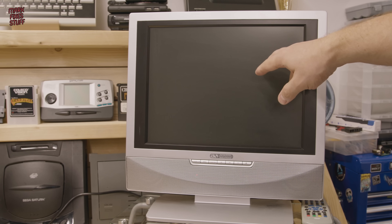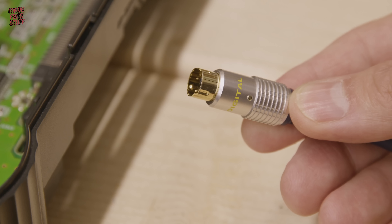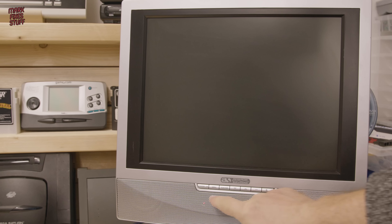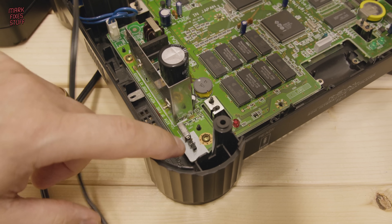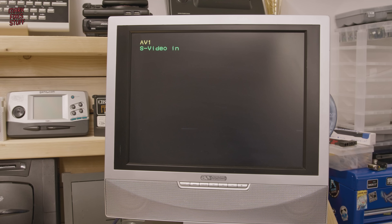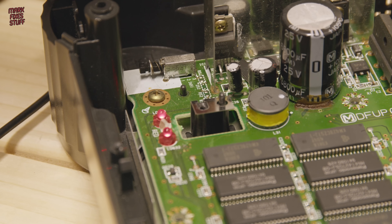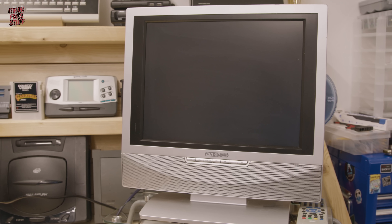For visual output we'll be using our bench LCD because it's got great connections including S-video, which is the best video output you can get from an unmodified 3DO — it's pretty damn good. With the screen on and S-video in selected, we power on our console to see if we get anything at all. We do get two LEDs, which is a really good sign, but it looks like the picture's missing sync. That could be down to the cable or the way I've plugged it in, so I gave it a wiggle. Firing up again, we got a solid image and no lack of sync.